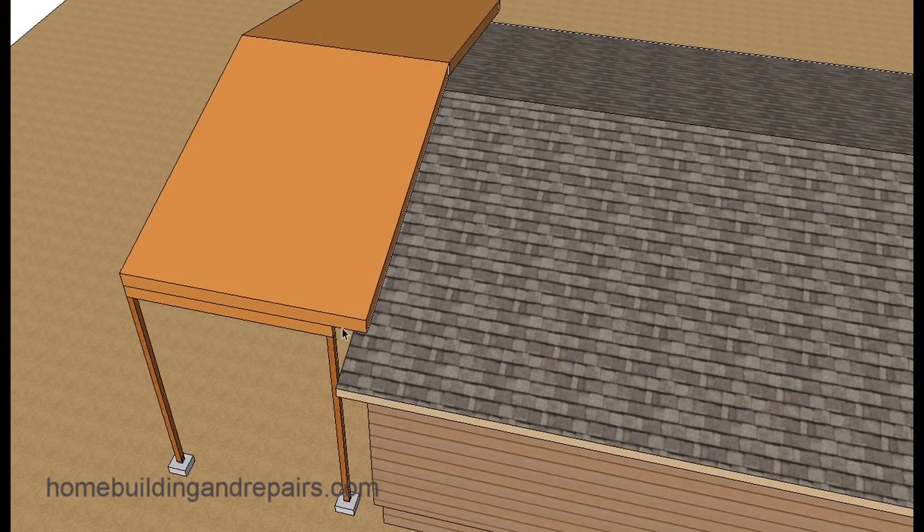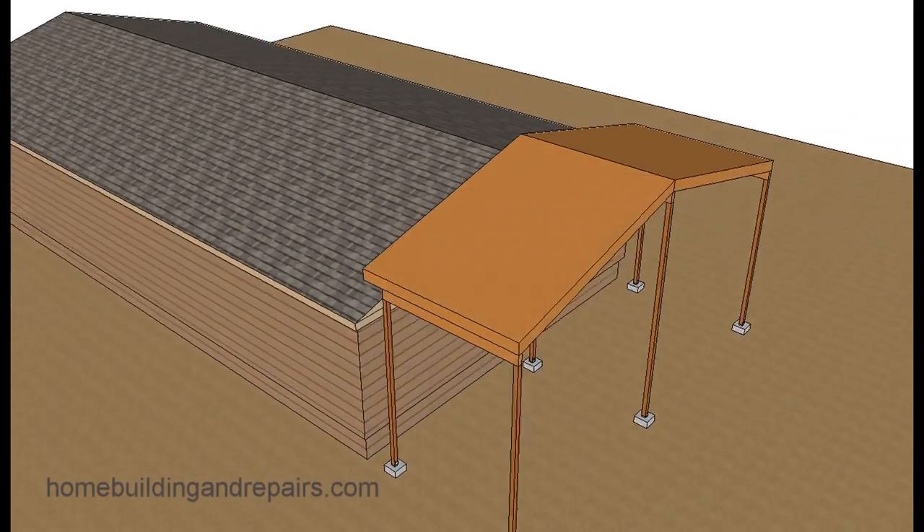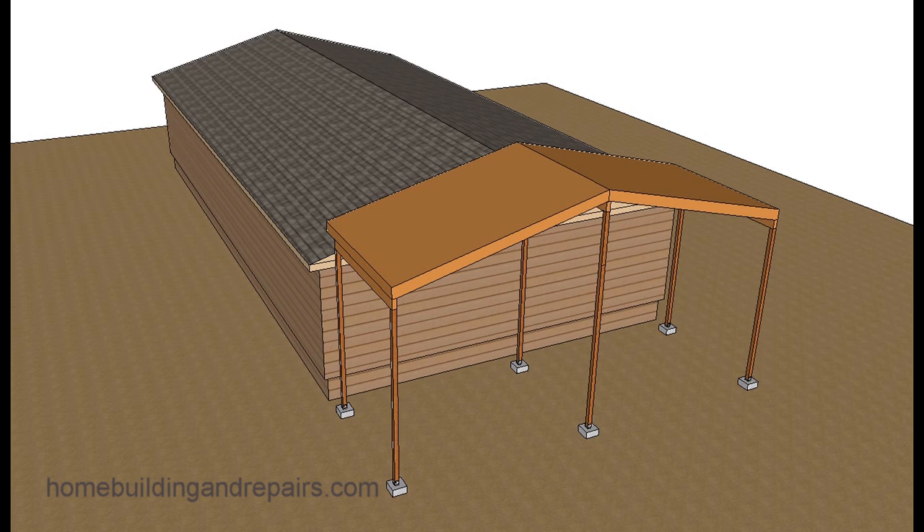Leave it at least an inch away from the roof and make sure that debris doesn't get trapped in there. That's the biggest problem — you'll have rot with something like this. I didn't go into a lot of detail on this because I think it's self-explanatory: you don't want to be attaching it to a modular home if you don't know how it's constructed. If you do know how it's built, you can do more modifications using some of the other videos. This applies to roofs, but also to decks and stairs — keep these things separate from the mobile home if you don't know how they're built.